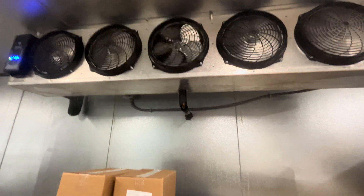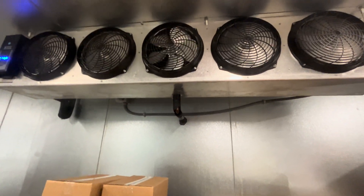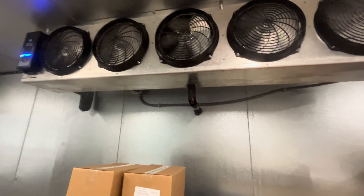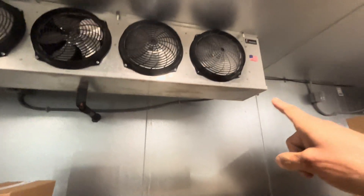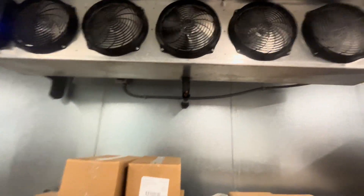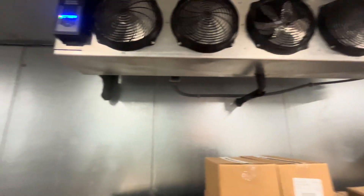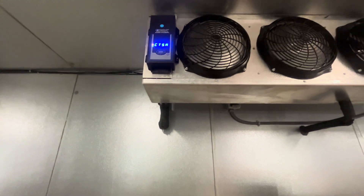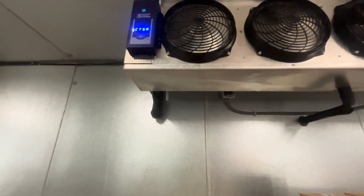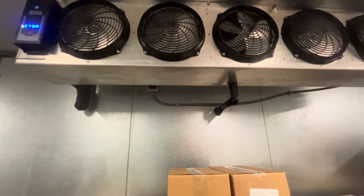So these are two-speed ECM motors. But that one's turning on and off and spinning in the wrong direction. The last time this one was doing that, it wasn't running at all. So that's definitely interesting. But that coil temperature sensor alarm is what that is, and I got the replacement for that. So I'm going to change those sensors out.